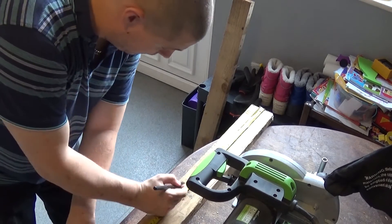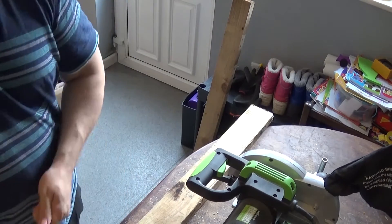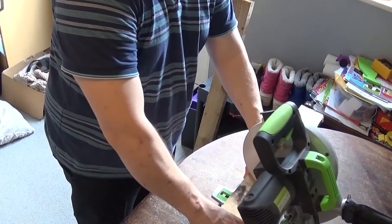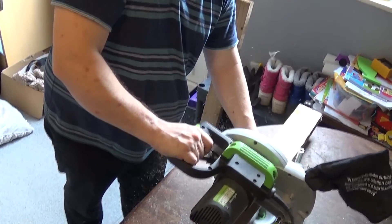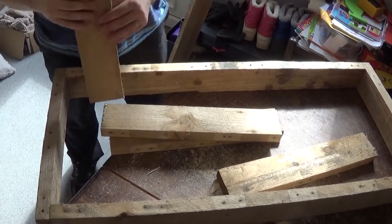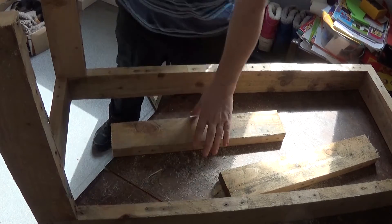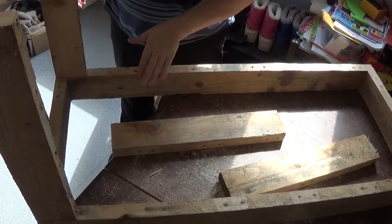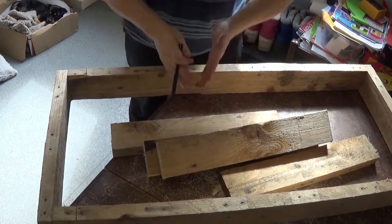This one's dead on 100cm, which means I can cut it dead on 50cm. Because I'm using a circular saw and cutting a small cross section, I can just make a little dot and it will cut it dead straight for me. When we connect these two together, the posts will be set up, and that will be connected on the top. We're going to put pieces of wood down here as the floorboards, so we need to fill this area with planks of wood.